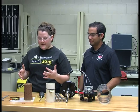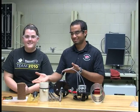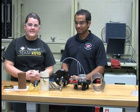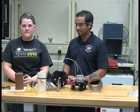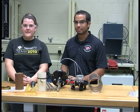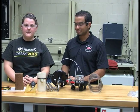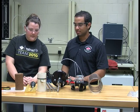The main material that you need is your soil sample. This can be obtained by using a Proctor test, which is D698, or you can also extract this sample from a Shelby tube taken out of the field. Just to note, this sample must have a ratio of 2 to 1 for the length to diameter.